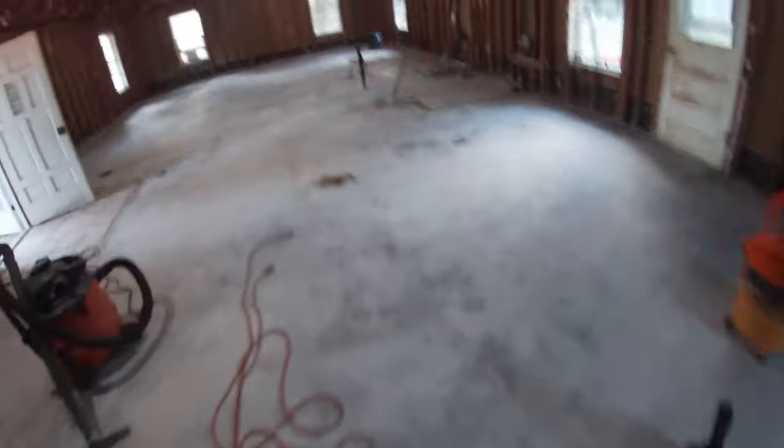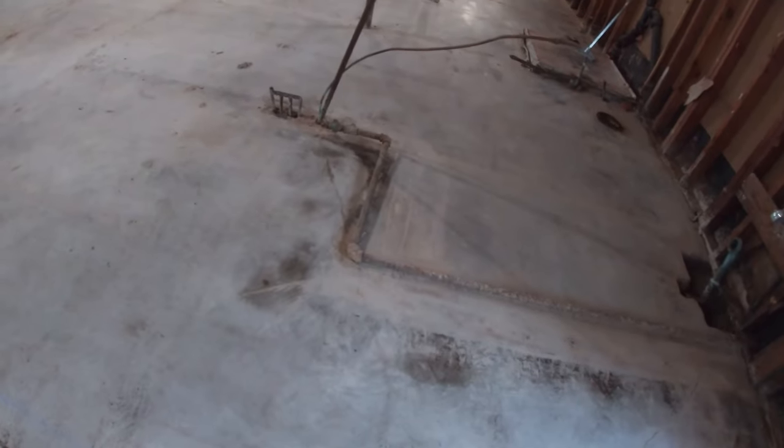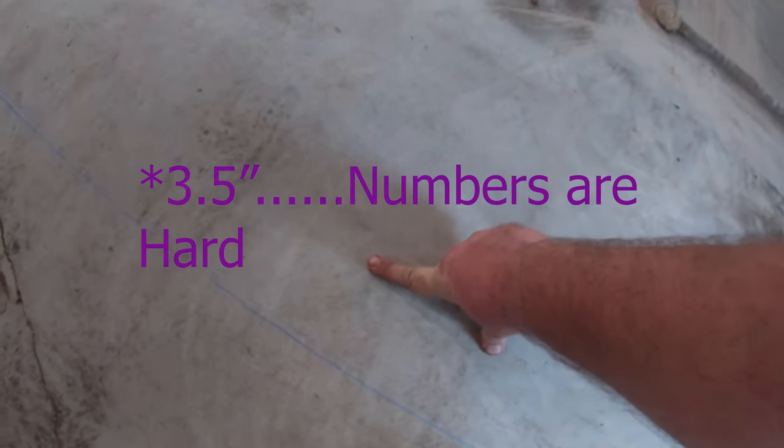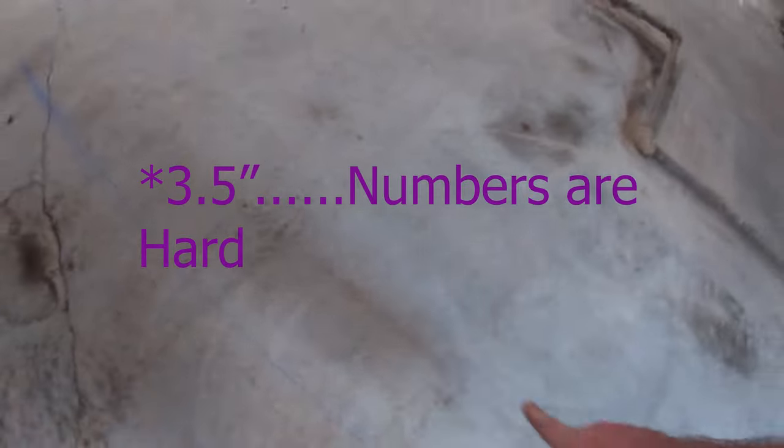All right, so we managed to mark the first wall. We literally just measured it out, made the marks on where they need to be on the endpoints, and chalk lined it. So that will be the exterior edge of the 2x4. The 2x4 will run from here 2 inches in, or whatever the actual width of a 2x4 is. I think it's slightly less than 2 inches. So that's where the wall base will be.